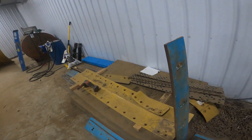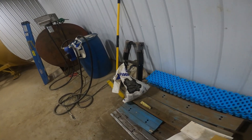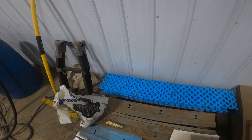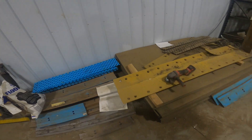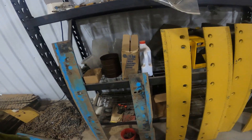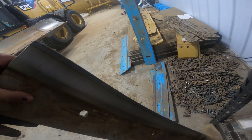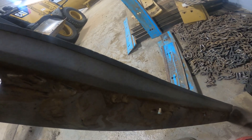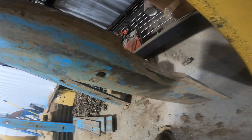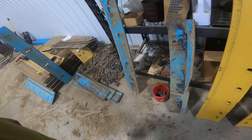I got a set of regular blades — these are called the Ram — and they're just a regular steel blade. I got the P300s, these are the ones with holes, and they do a really nice job in the spring for blading. Then I had a set of carbides on here. This township has a lot of bad rock in it and I don't particularly care for these carbide edges because there's no hard facing on the front of them and they chip very, very easy. This one here is in pretty good shape, but the other one — yeah, not so hot. Got a big chunk missing out of that one, carbide's gone, that blade's kind of all garbage.